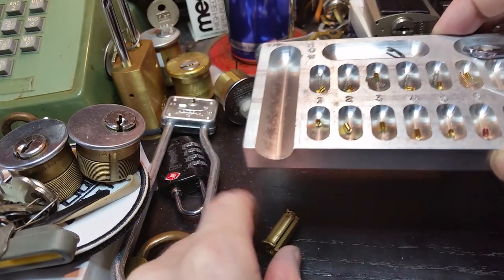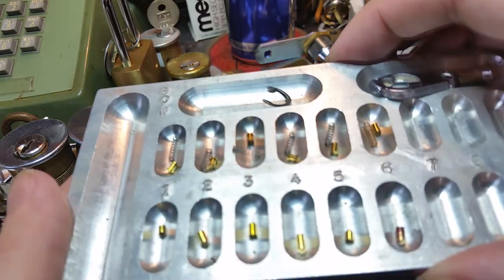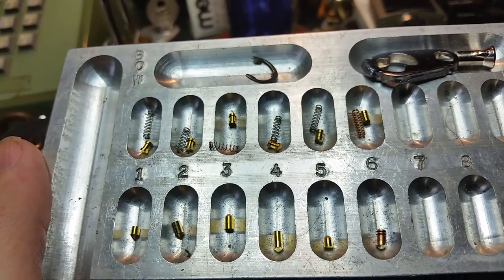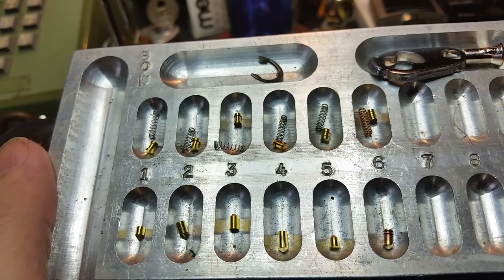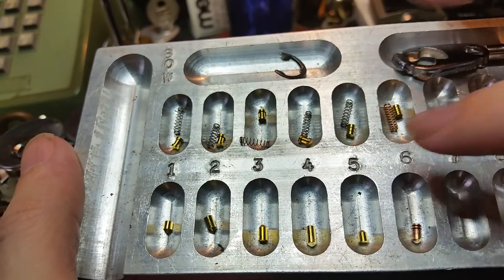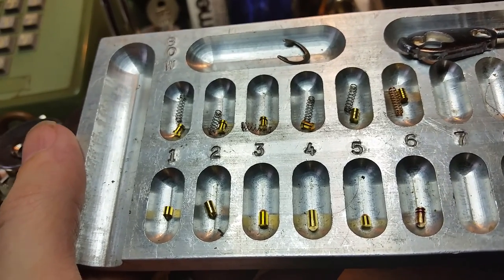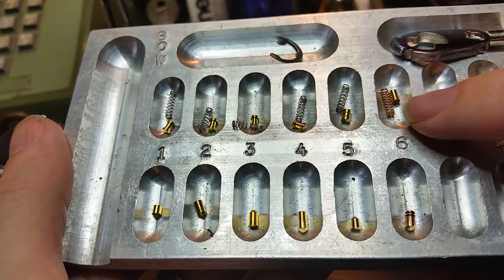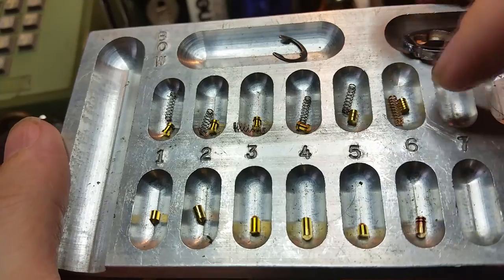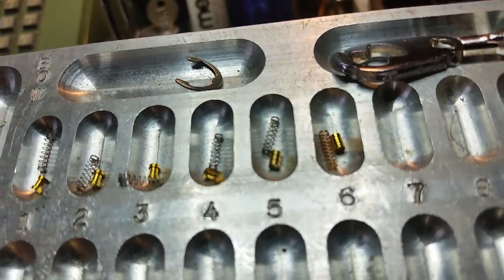So, let's take a look. No real threading on the chambers or anything. Normally these come only set up for 5 pins, but you can add an extra pin that will ride on the tip of the key, which is what I had done here using parts from an American lock pin kit that I have. And you notice the Master Lock serrated pin is...